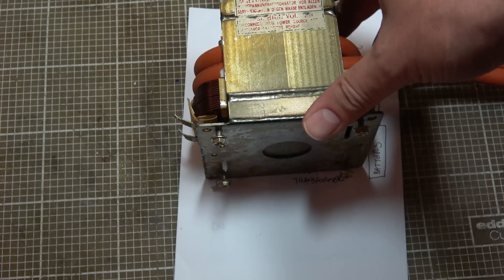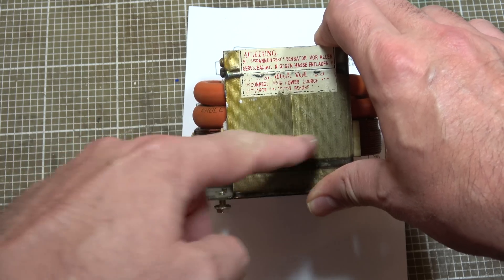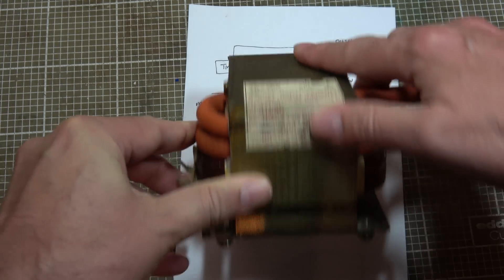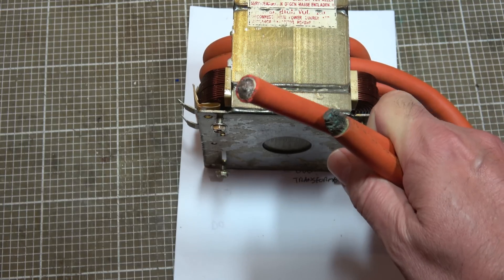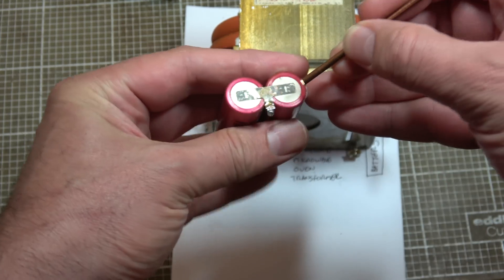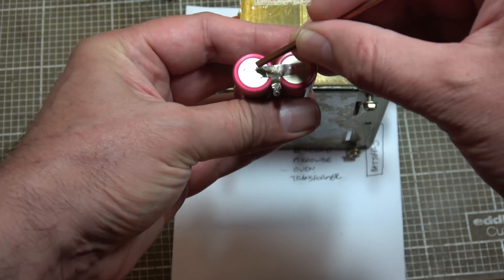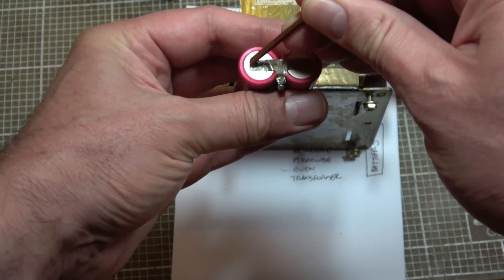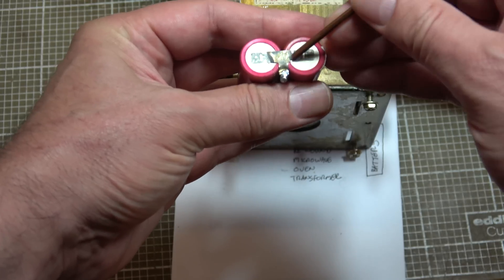So we'll quickly discuss the theory of operation here. Here's my rewired microwave oven transformer - the bottom one is the original mains voltage coil. Mains goes in there, generates a magnetic field inside, which needs somewhere to go. It goes out through these two turns of wire and comes out this end. I haven't measured it exactly, but it's around about two to two and a half volts at lots of amps - probably about 600 amps or so. We funnel those amps down into some kind of contact point. On this battery you can just about see little circles - those are the contact points where it was welded in the first place, using shaped copper rods with little pointy bits that push in, pulse the current through, and melt just enough metal to fuse it together at those spots.